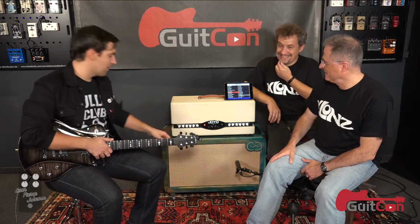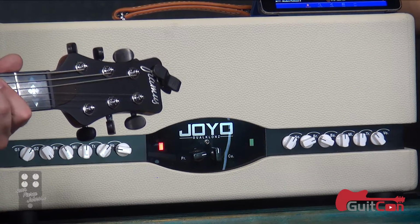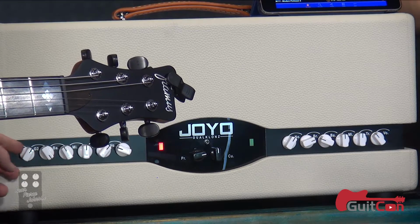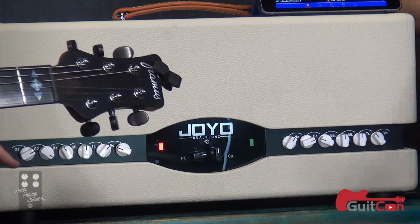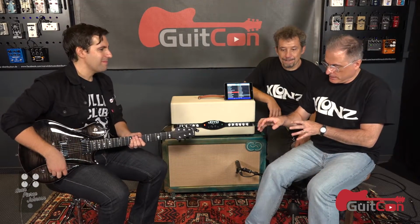Yeah, and that gets pretty close. I have experience with real 5150s. That gets pretty darn close. I think if we just boosted the volume up a little more, I think that gets pretty close. And the cool thing is that there are 2 gain controls on the modern channel. So it's essentially giving the end user control over 2 different gain stages. Exactly. There are 2 gain stages which are cascaded. Normally the second gain stage in all amps is fixed. Yeah.